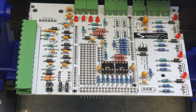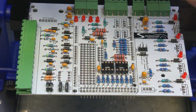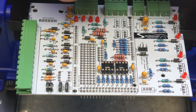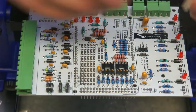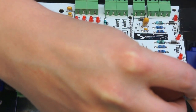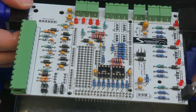With the connectors installed, the next thing to pop in are the MOSFETs. These are relatively straightforward. The only thing to watch for is the alignment — you'll notice these have a tab on the top of them. That tab aligns with the line marking on the board, so in this case the tab should go to the outside of the board, standing up straight. Again, bend the pins at the back and solder from behind.